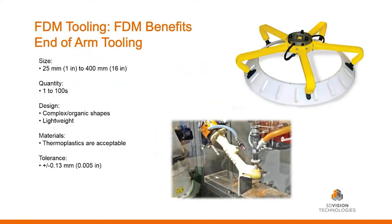Hey Jeremy, you said it won't mass produce, but for low quantities it's a perfect fit. When does it become the point where you say you need metal tooling over plastic parts? That's where you take the number of shots you can get out of the printed part versus the metal part and do your averaging. Eventually the plastic is going to wear out — the printed part is cheaper, it's just how many times you have to replace it during the life of your end product. So in the thousands it sounds very doable, but maybe tens or hundreds of thousands, you really have to look at traditional methods. Actually, tens to hundreds is still in the range of 3D printing — it's when we get up into the thousands where we'd go back to traditional.